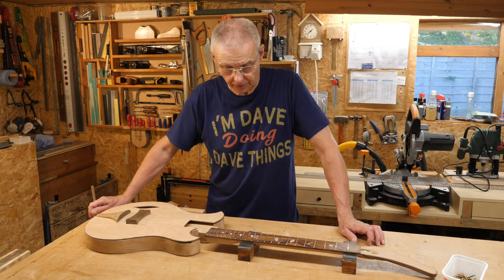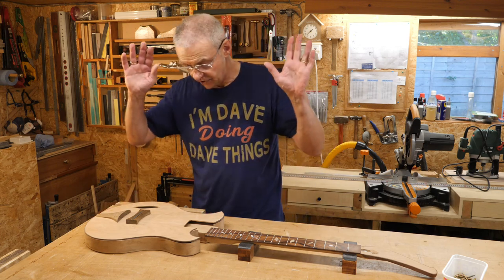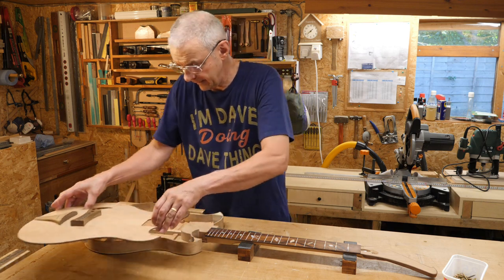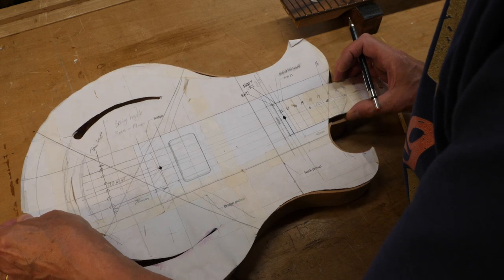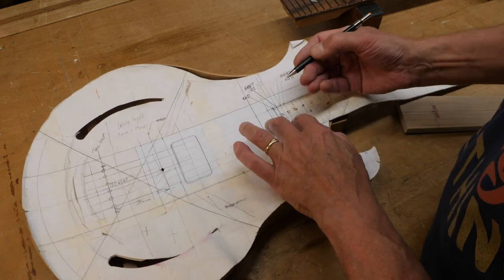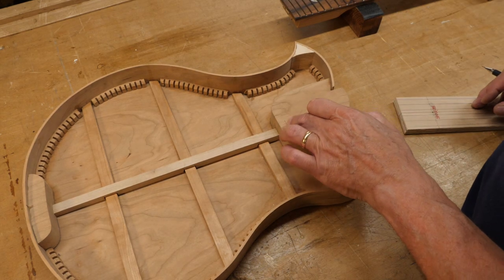I think the next thing I need to look at is how the neck's going to fit the body. It's another really hot afternoon and I have a job which I really can't put off any longer - that is to get this neck fitted into this body. I need to do that before I can set the height of the bridge or do anything else. So first thing I'm going to do is take this top off. I need to get some measurements sorted - I need to know the position of the 22nd fret, and to do that I'm going to lay this template on top of the ribs so I can get the position.